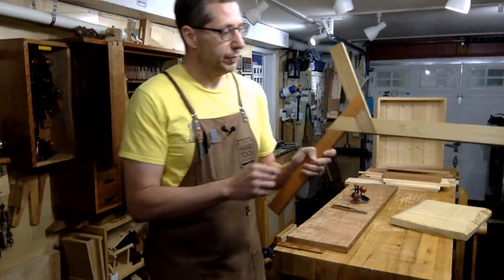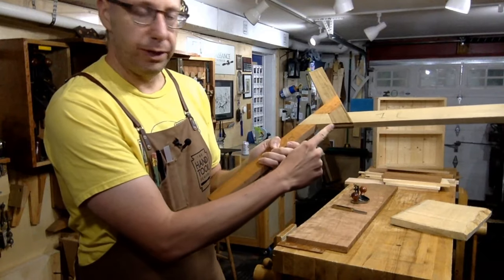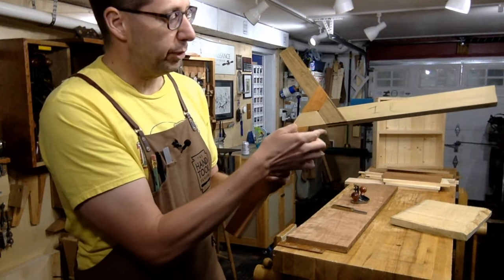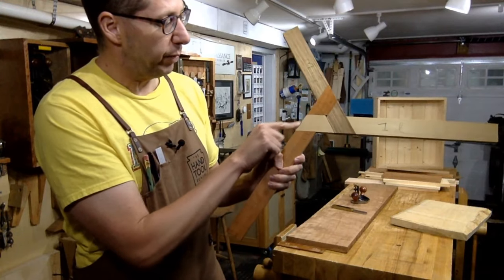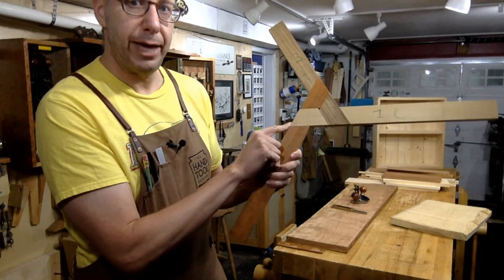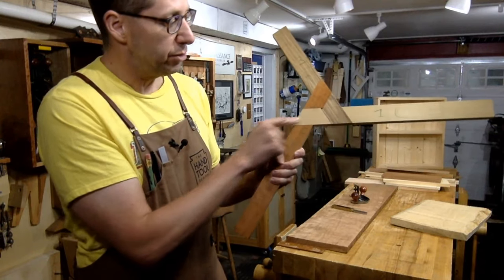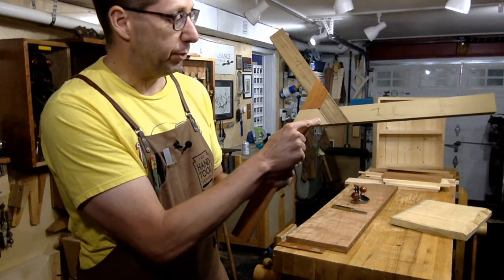But even then, the end grain isn't really a reference surface here, because this could be proud and could be planed flush. So was it really important to get that flat? Well, it was important to get this angle flat, because I laid out my baseline by running a gauge against that end grain. So suddenly the end grain became important, making sure that it was flat and at this angle. This is a 60 degree angle, so that I could appropriately lay out my baseline. So there, it's very important.